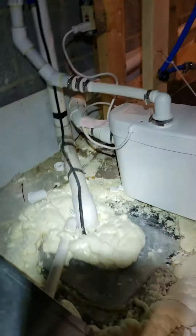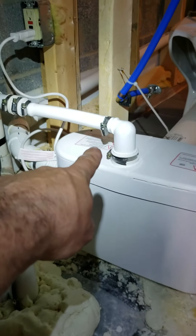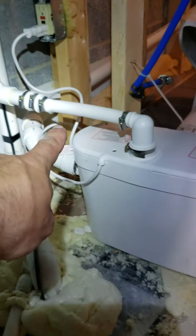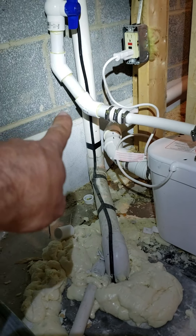This is my sump pump here. I had to work around my sump pump. So this is a one-inch pipe on top that comes with it, and you can't use any 90-degree bends — you've got to do 45s to make it 90.